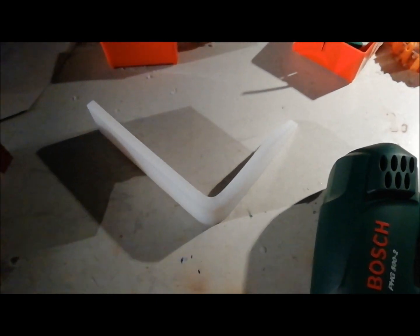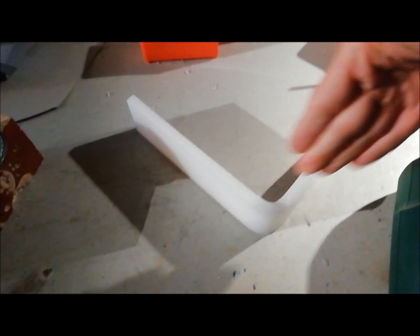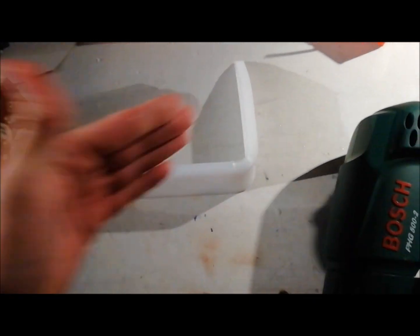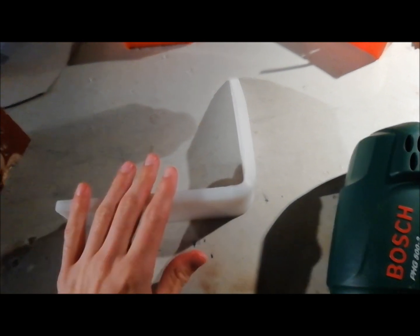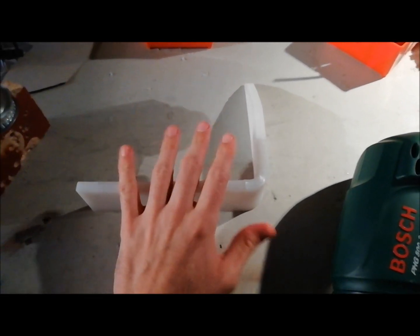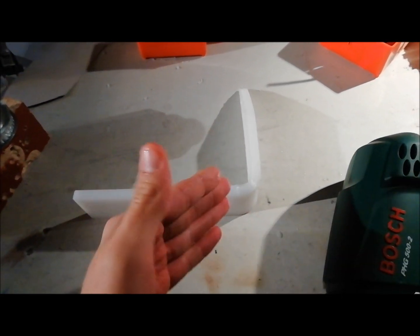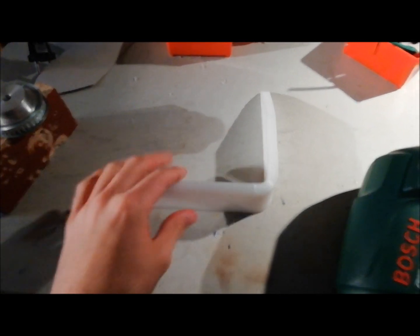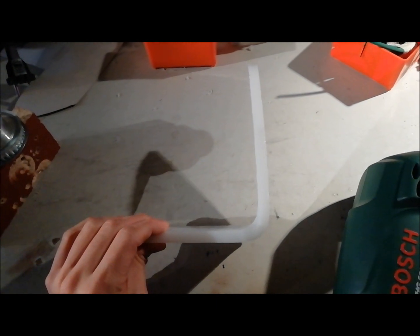You can also go for pieces with a very gradual bend, but that will require a bit less heating. We went quite far with the heating here because we wanted a 90-degree bend. If you want a more flowing kind of bend, simply don't put as much heat in — the bend will be more gradual and won't be as sharp.